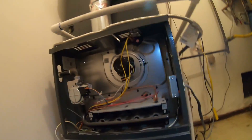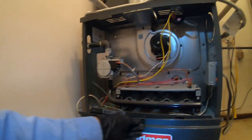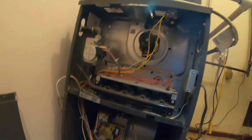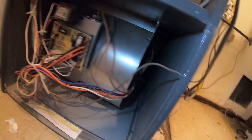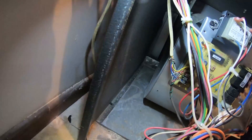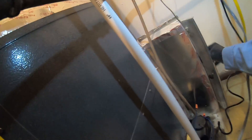I'm pretty sure you noticed a big no-no that they did on this furnace - they installed the return behind the furnace where you're not supposed to cut in through, but that's where it is. I've already mentioned several things to the customer that need to be fixed. This is just a maintenance call and I'm actually doing more than I should be. Typically on these maintenance calls I'll do just my routine filter change, clean the condensate pump, flush the drain, stuff like that. The drain pan if it's dirty I'll clean it out.